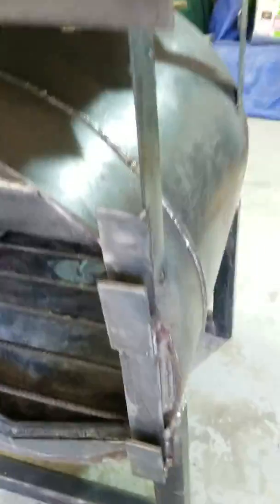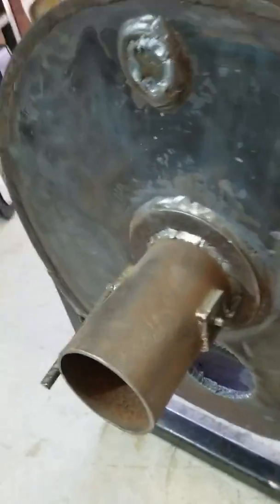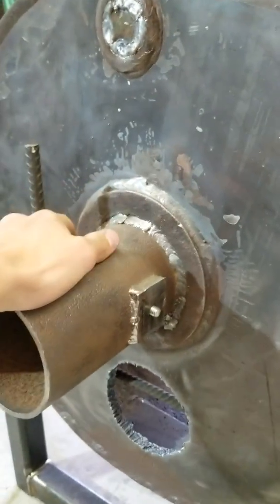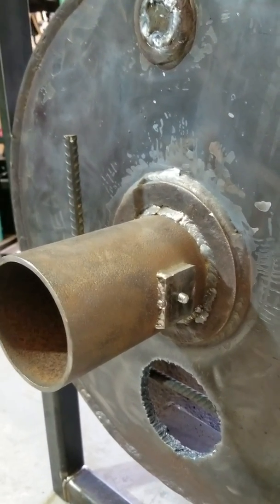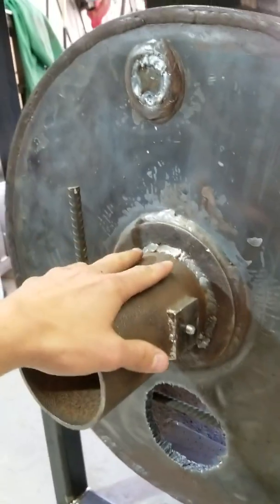That's just a grate. That plate back there can be welded on tabs. There was rust so I had to fix that hole. Around the back I made a flue — this was an eighth inch plate I had. There was already a hole there, so I got lazy and tried to put it there even though it's not ideal. Saved some time, welded it up, gave it a test light, and it just was not burning right. So I knew I needed to get it lower and ended up cutting the hole there. I'm going to have to cut this off, put it down there, and patch that hole.